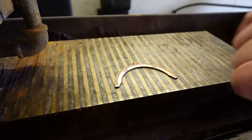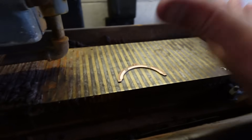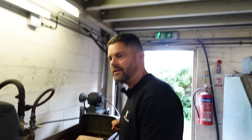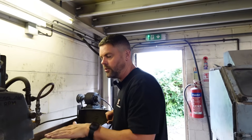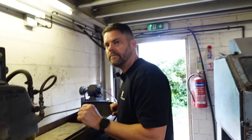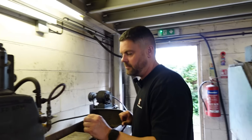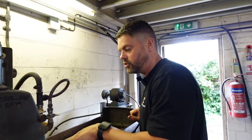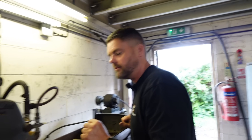You've got to be careful how much you take off because the coating isn't very thick. These notches indicate the actual thickness. What I tend to do is machine the back first — make sure it's flat. They've got a steel back. The first set I had was a bit bent and you can tell that straight away. I keep a few sets in stock to get at least a flat set. So I take a thou or so off the back, make sure it's flat, then turn it over and face two or three thou off here. That's why you use the five thou thicker ones — so you can take some off and get them flat. Make sure the back's flat, the front's flat.